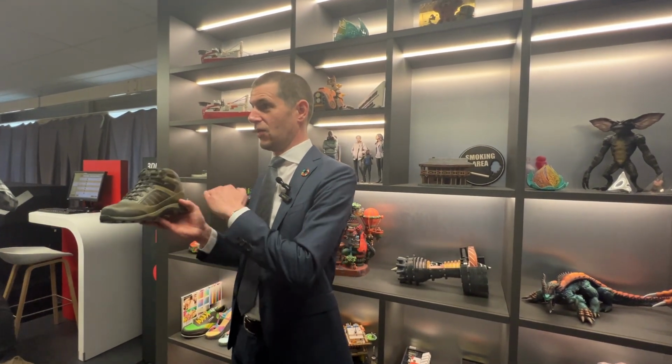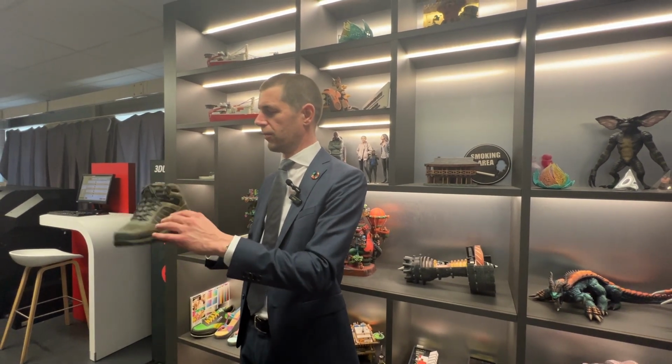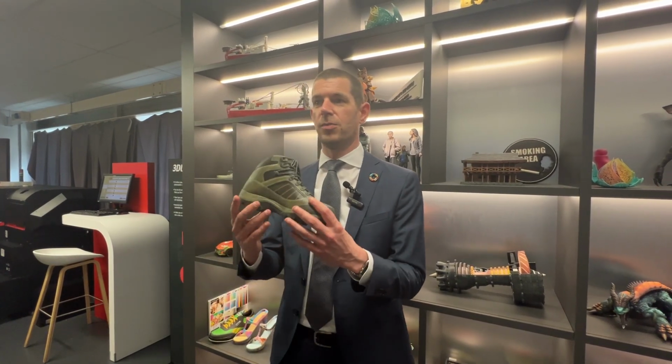There's a support layer around it because basically it's layers of UV ink, and then we have a support material because if we print this like this, we can make this pure in the air. So this is all filled with a support material which is also jetted with inkjet, and which is water-soluble. It dissolves into water. So basically the whole thing goes into water with a little bit of movement, and after a couple of hours, it comes out completely clean and completely in color.